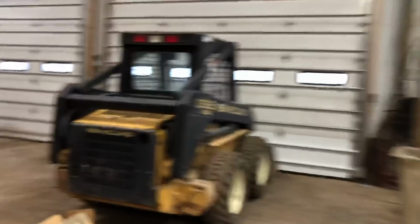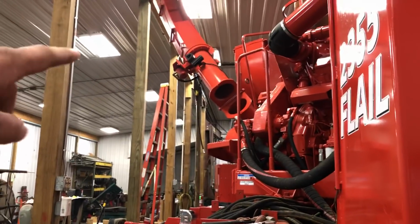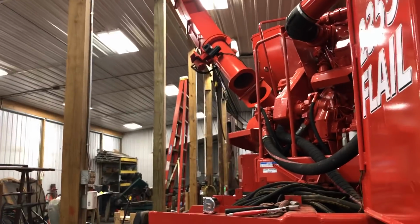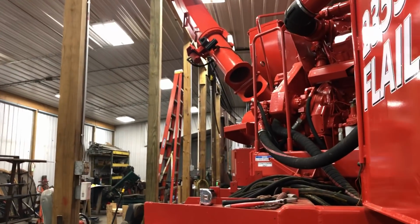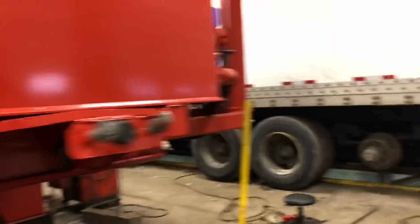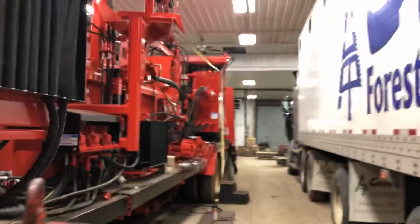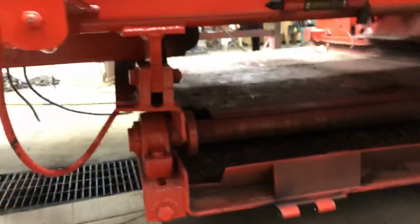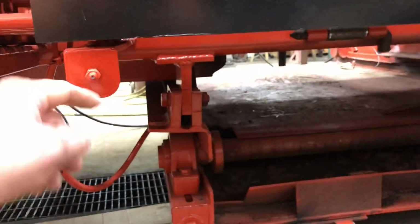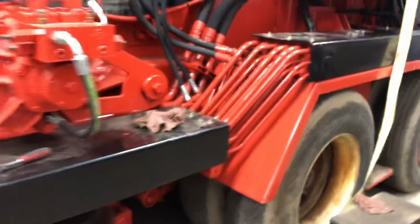I got to make one more hose over here for the conveyor, and your conveyor's got the two bearings for your top drive shaft, and there's no grease. We're going to have to run some grease hoses down because you have to climb up the conveyor to grease them, and it's in the middle of winter. Not a fan of them hanging off the side of the conveyor. Not fun. But like the bearings for this side of the conveyor where this roller shaft is, you have one here. They got this one here. I'll tuck that up out of the way. I don't like that hanging down. That one's gone, so put a new one on there.